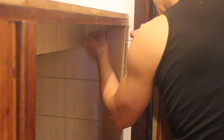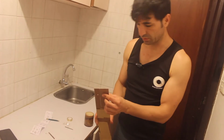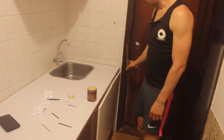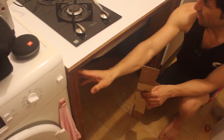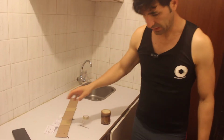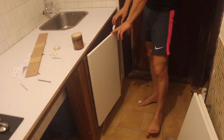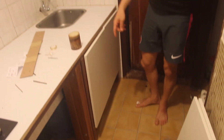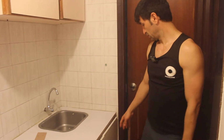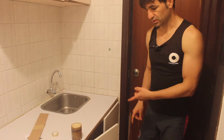So the cupboard that we make that resembles the leg and where the hinge goes, we try one leg on it and then mark the holes, make the hole, and with putting that hole on each leg and making the holes, it's easier to put the small part of the hinge that goes inside the leg. When you put that one, then it's easy, the whole door and hinge just locks down automatically. Later on you can adjust, because there are two screws on each hinge, that you can adjust the door to come a little front and back and up and down, and then make doors on a similar line to look as pretty as possible.